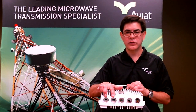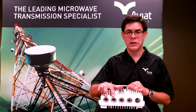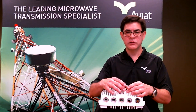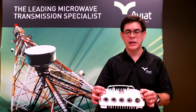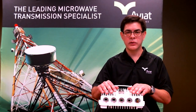The last two ports on the radio are SFP cages. Here we can plug in 10 gig SFPs that communicate to the radio at 10 gigabits. Tying all of these interface ports together inside is a 50 gigabit non-blocking carrier grade ethernet switch, which gives us a lot of flexibility in how we can interface with and configure the radio.